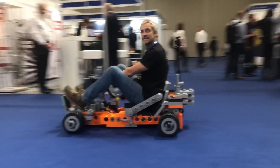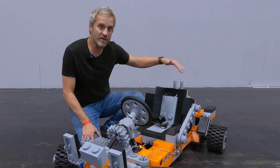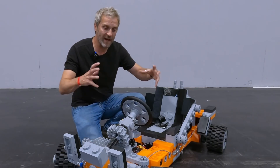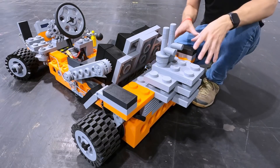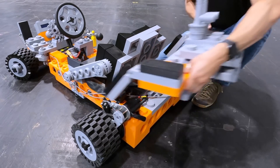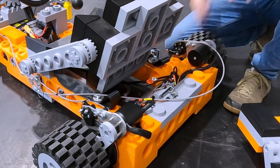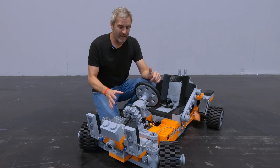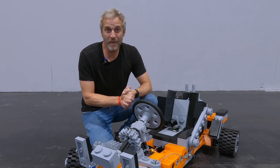Let's have a refresher on the modifications I made to the XXL Go-Kart since my last video. New twin braking system — there are twin disc brakes on this now because of that split rear axle. And there are twin drives back here, plus electronic traction control built into the VESC controller. The back end of the go-kart looks a little different because I've added this dressing, hiding the motors, disc brakes, and of course that new axle. The seat is further forward because the chassis got longer. The most important thing is it now actually turns, even at low speed — crucial if you're going to go on a go-kart track.